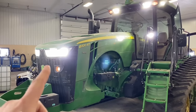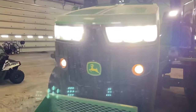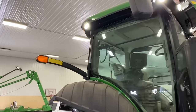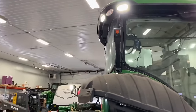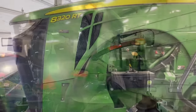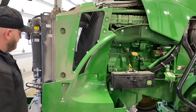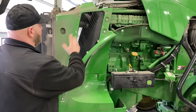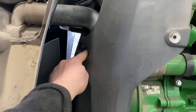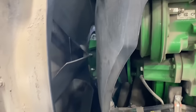All our lights are working — these LED lights are really bright. Beacon lights are going. If we have a light burned out it'll actually set a code for it. Now we'll get the hood popped on this guy, open it up, and take all these shields off so we can get into the fan drive, batteries, and check all that stuff out. To get the black shield off, there's one 13mm bolt there and two right here.